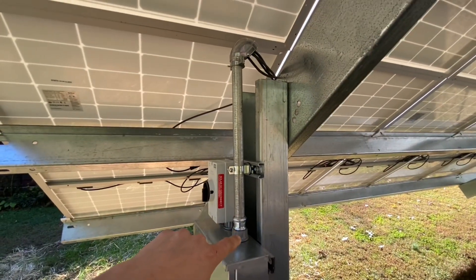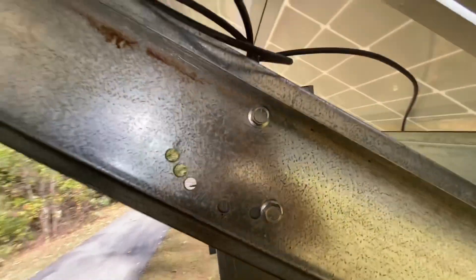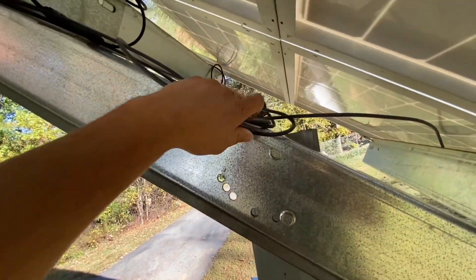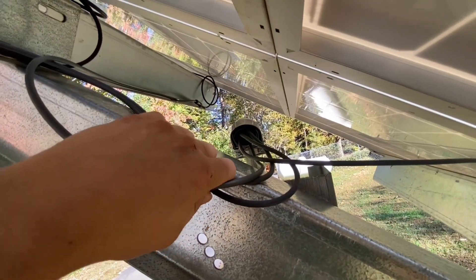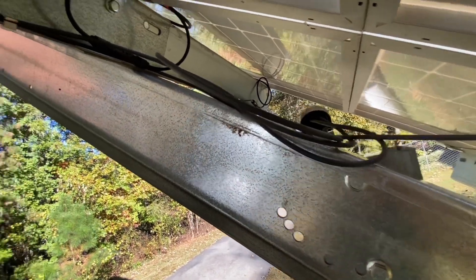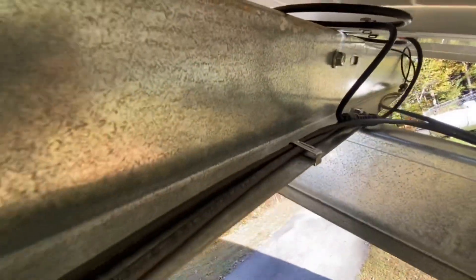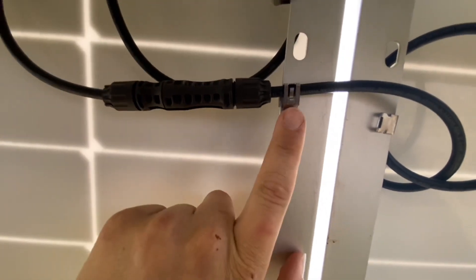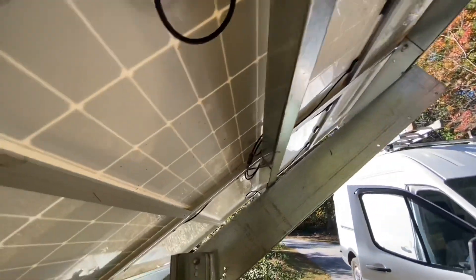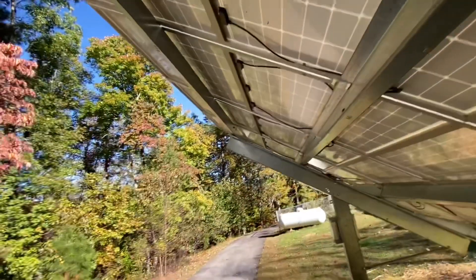We always do another Myers hub, and I either do one inch or one-and-a-quarter right here. One inch is always enough for bringing in some solar strings. Always want to get your wires to go down first before they go back in — that allows you to drip any water off. I'll probably get another clip on there before I'm all done. On our wires, we're using two or three different types of PV wire clips: a four-wire clip that holds a bunch more wires, a right-angle clip that clamps the wire at a right angle, and a regular straight PV wire clip. You just want to get the wires protected.